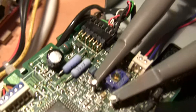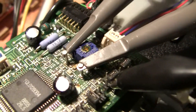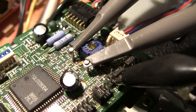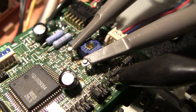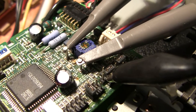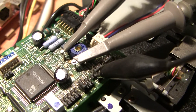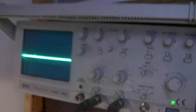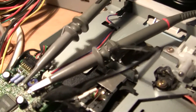This is where the head signal comes in from both heads. Here's the head. What we're looking for is the amplified signal from the head before it's been pulse-shaped or generally messed with — specifically an analog signal. The signal is differential, so the two probes go into a scope, and the scope is set to do A plus B inverted, so it's going to show the difference between the two signals.